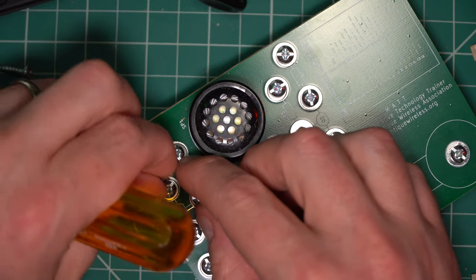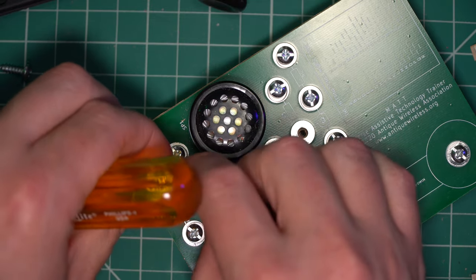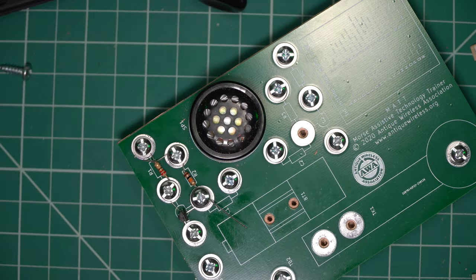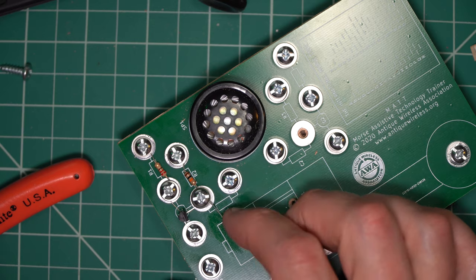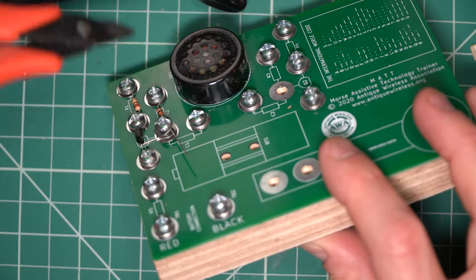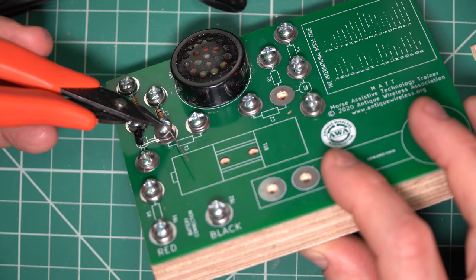I'm going to feed the wire around the post. Give it a half turn. And tighten it down. Okay. And then I'll do a little snip. Okay. Now, I seem to have already did exactly what I needed. I've got the transistor again below the lowest washer, then the resistor under the second washer, and then the screw head.